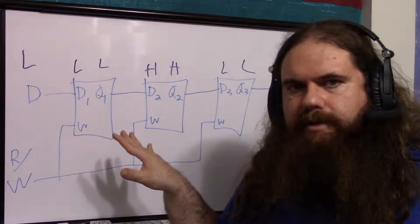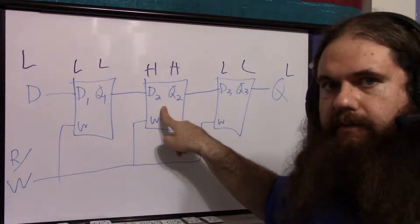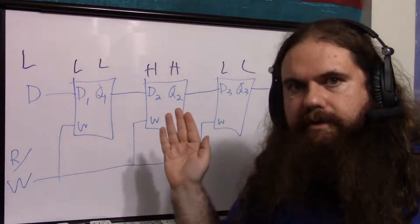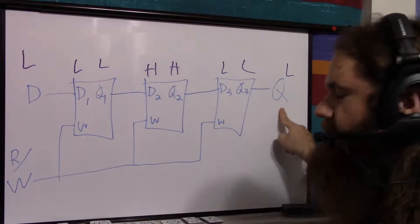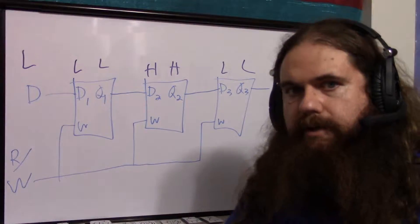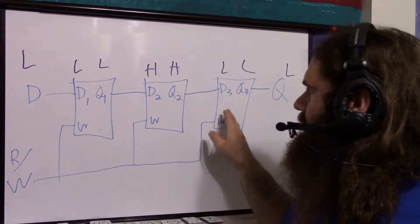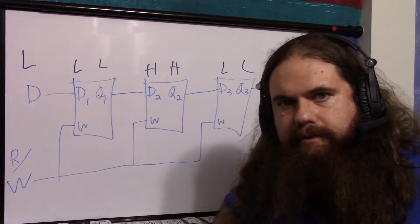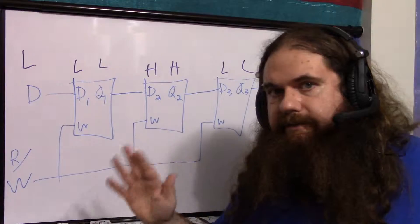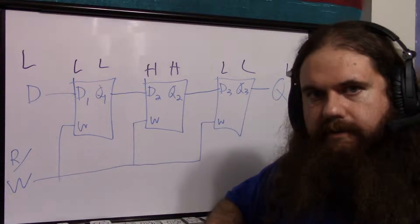What about reading? Let's say you stored three bits at some point: set a bit, read-write, set a bit, read-write, set a bit, read-write. The first bit you put in is at the end, so it's first in, first out. You see what Q is — that's your first bit. Issue the signal: the third becomes the second, the second becomes the first, and the first becomes whatever D is. If you're only reading and don't care about what's left afterward, don't bother setting D — those positions become garbage. This is called a destructive readout. That's why it's both a read and a write signal — one signal reads the input, sets the output, and shifts everything over.